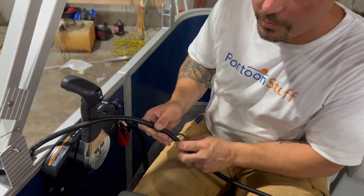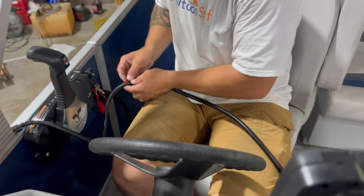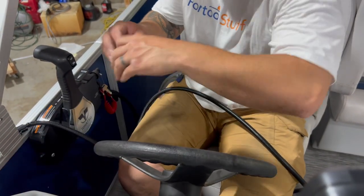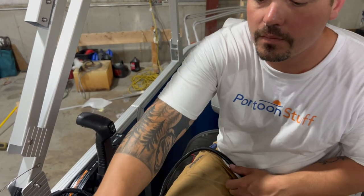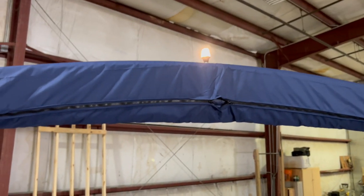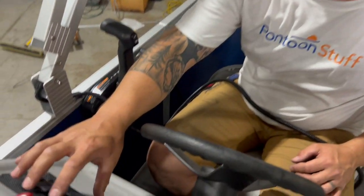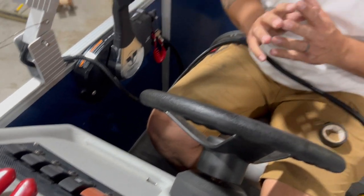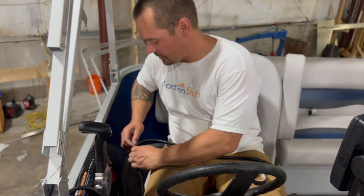We run the split conduit and it helps to add just a little bit of electrical tape every six to eight inches to help keep everything nice and tidy. Now that our power's all hooked up — always nice to see our anchor light working when we use that switch on the dash. That is one of the huge beauties of the accessory harness from pontoonstuff.com — everything plugs and plays with their switch panel. Literally just plug it in and all of my switches correspond to the wires that run out, then all I have to do is tie into those.